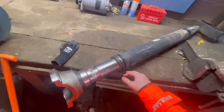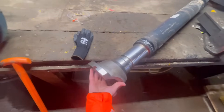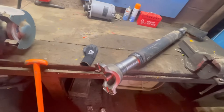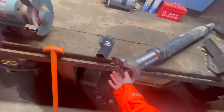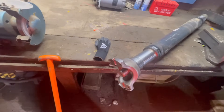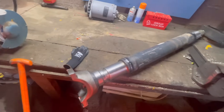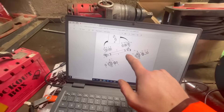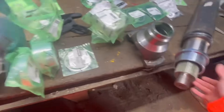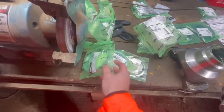They've had this remanufactured - it's been cut and a new piece put in and re-welded. Thankfully I didn't do any welding, so it should be okay. This is now nice and tight on the shaft, remanufactured at both ends - should have a nice tight shaft. There's a massive nut that goes in there, 70 or 72 mil - can't quite remember - and that needs to be tightened to FT. If you don't know what FT is, go look in the shop manual. We're going to build all this up, put it in the back of the van, and head up to fit it to the dump truck.